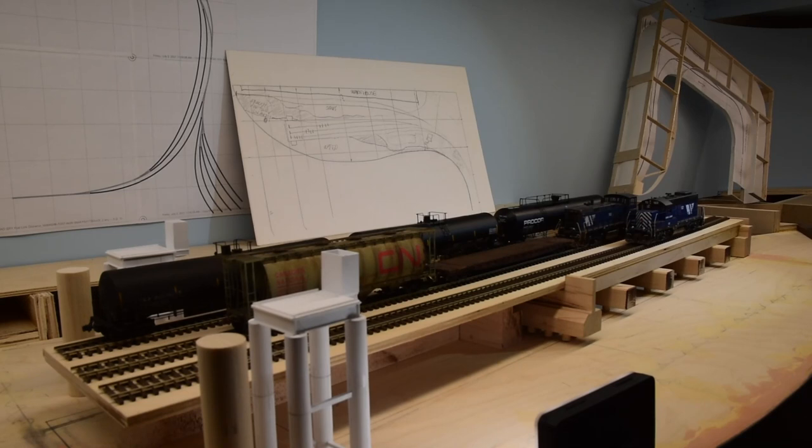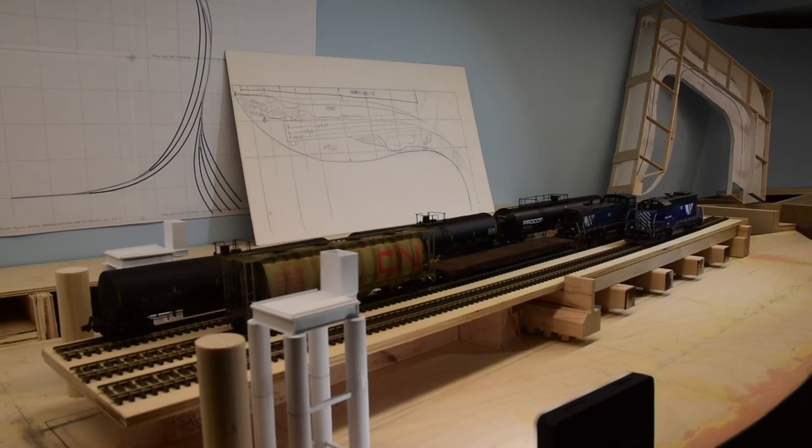I don't want three pieces of a model, let's say, all interconnected and not lining up and going bumpity bump, right? So you can see it's one slab. I'll jump off the tripod here in a second. It's one big slab of 3/8 7-ply birch plywood, and I'm running a maple spline down the center of it, for obvious reasons, for warpage.